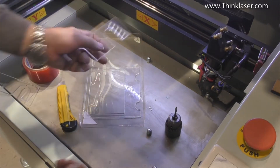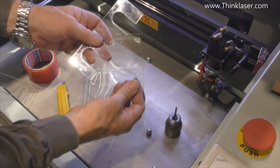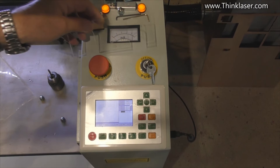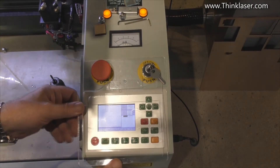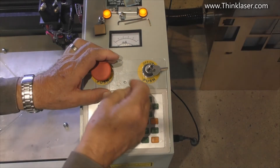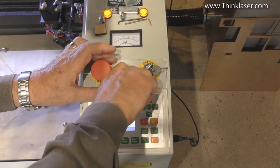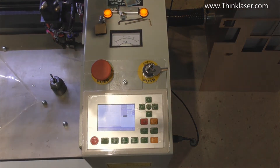I'm using M5 size — you can use any size you like — but I happen to use M5 because I've got some very short M5 screws, they're six millimeters long. We're going to put that piece there like that, and then put this piece here like this, and hold the two pieces together with a screw like that.